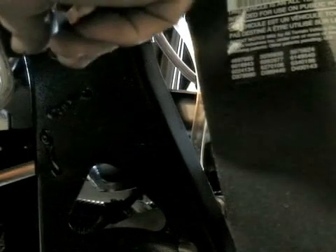The other thing you want to do is make sure that the line isn't damaged and it's still attached to the gear case, because if it's not, that just makes it a lot easier for dirt and water to get inside that gear case.